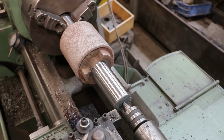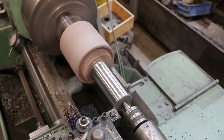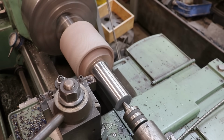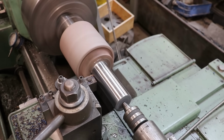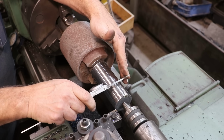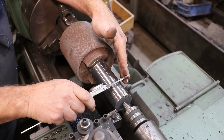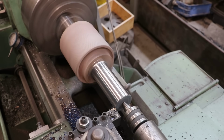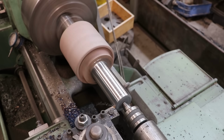All right, we're going to cut it right there, and we'll make a light pass to finish it up. Let me confirm where we're at here. I'm just going to dial into my final dimension, which is going to be 1.9375, which is 1 15/16. This will just be a light pass here, just to finish things out. Hopefully we'll get a decent surface finish on that as well.